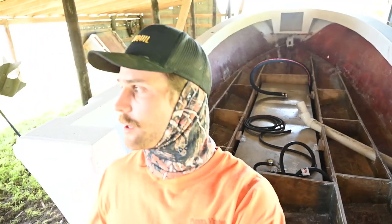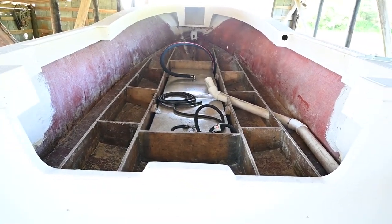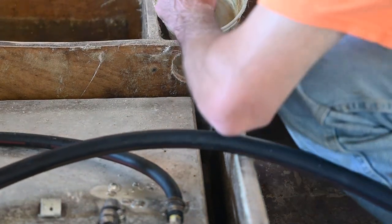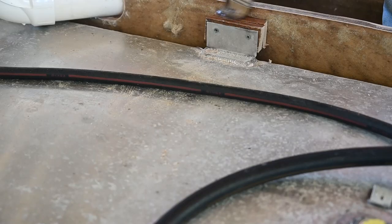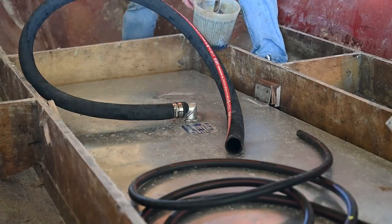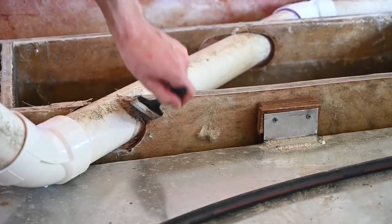Next tasks are to paint the bilge, paint the fish box, and foam in the rigging tube. I also have to hit that with peanut butter up there before I foam it in, and then I'm going to foam in the entire outer stringer. I cut out a lot covering all of the raw exposed wood with polyester resin, but rest assured I hit every single fresh cut — and especially this hole in the stringer, this funny-looking one. This actually comes back to bite me; I thoroughly regret it. Just cut out squares.